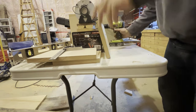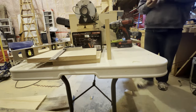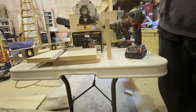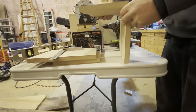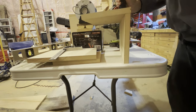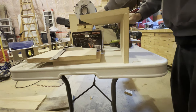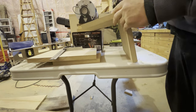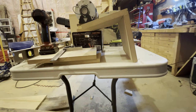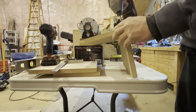Background, I got a box and a couple pieces of wood, and that's how I got my measurement. So once I lined the motor up to where it was supposed to be, then I did the measurements from that, but I had to build a little mock-up height so that I didn't have to guess and be kind of off by even a millimeter. I prefer to see things put together, and that's why I do a lot of mock-ups with different pieces of stuff, so that it helps me measure and see problems that exist before they actually happen.